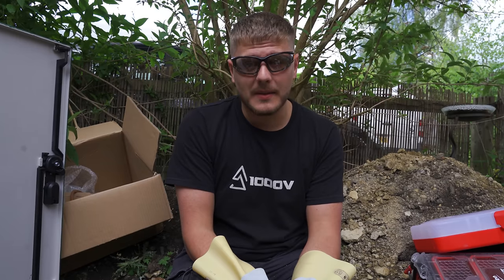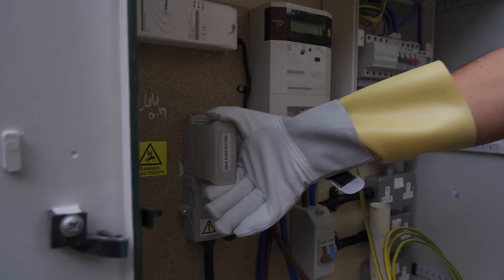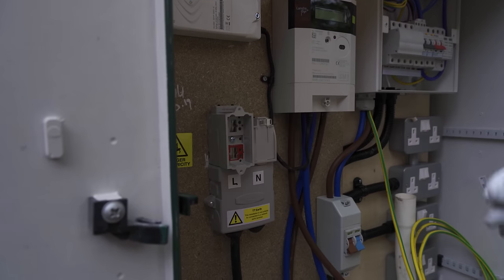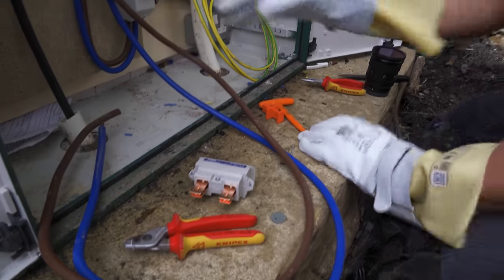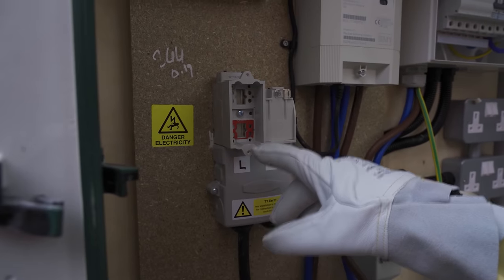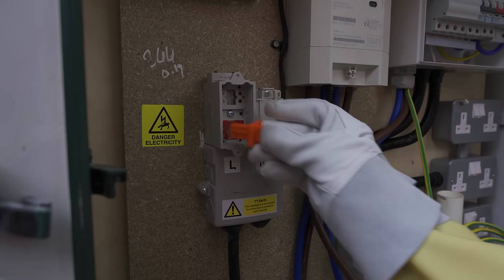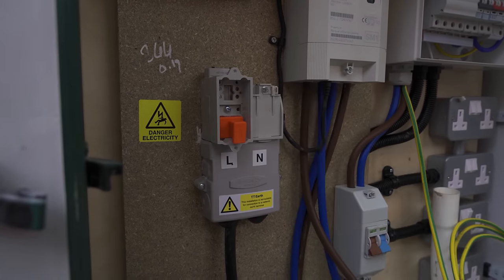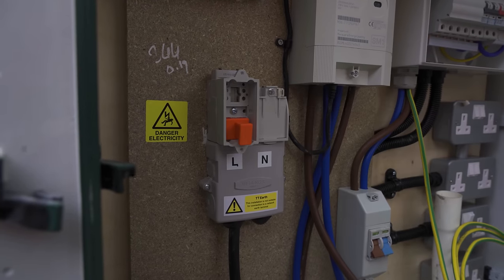It's very dramatic, but we have to follow the rules, so to speak. Gonna grab hold of the fuse nice and tight, give it a wiggle up and down, and then pull out. It's as simple as that. That is the fuse pulled. And then this red section in here is basically what's live. Those terminals there are live. So what I want to do is grab my cutout shroud and just plug it in there. That covers all of the holes, all of the nastiness, and then I can work in these top terminals here.